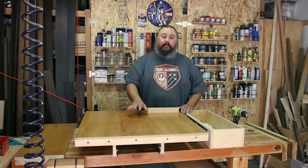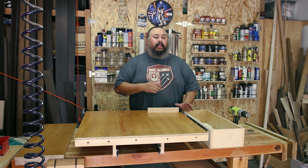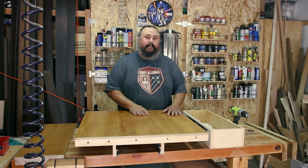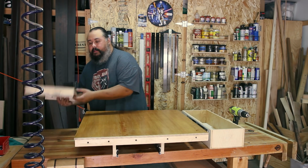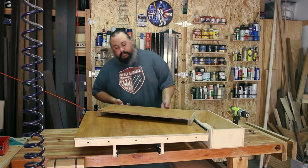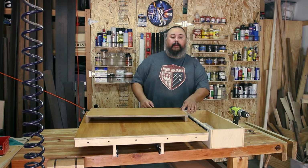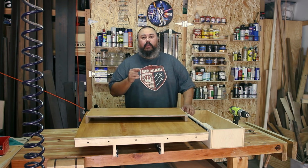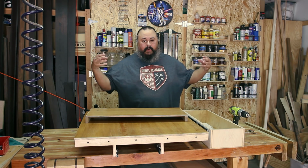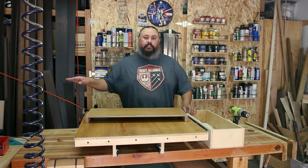And somehow I got really lucky with the big piece, because it felt level, and when I put the screws in, when I tapped it, everything went really well. So I was really happy with that. I was like, this is perfect, this is easy. Well, when I was doing the small one, I don't know if I got lenient or just sloppy, but I did the front and they fit well, they were level. And then when I did the back, even though I had leveled the table, I guess when I drilled the hole, one of the holes must have moved a little bit, so when I tighten it and it goes into the countersink of the rails, it shifts just a little bit so it's no longer flat and level.